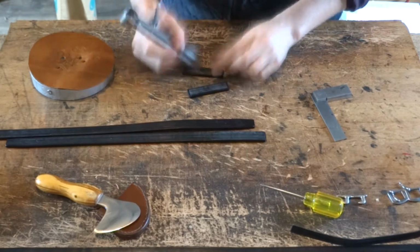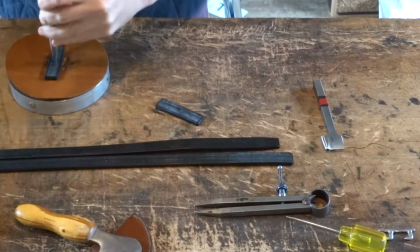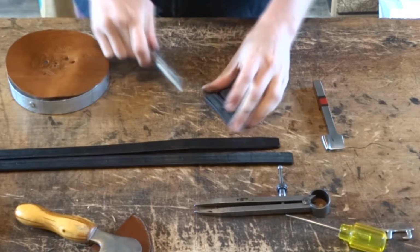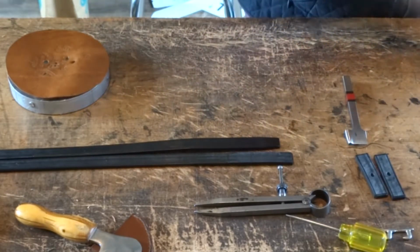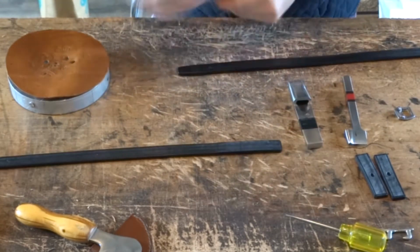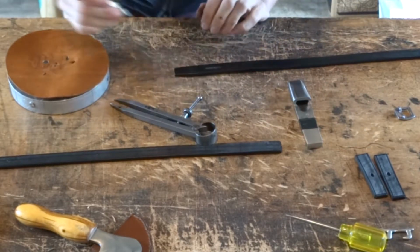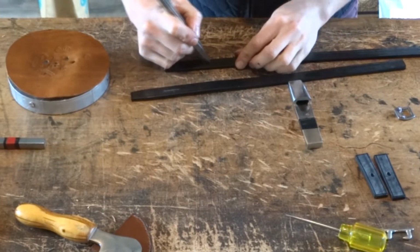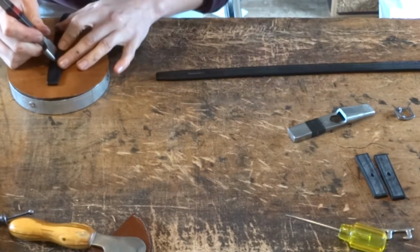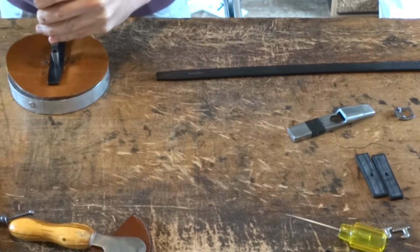So first of all, you want to just even up the holes on your billet and punch an oval number 1 hole at that 1 1/8 mark. On your main cheek pieces, we're going to be using a pipping punch, sort of down the end. So you want to even up where you marked your hole. Now that's going to be the centre of the eye of the pipping punch. So you want to mark just a little line up the strap from that, so that your pipping punch can follow that, and punch this all the way through.